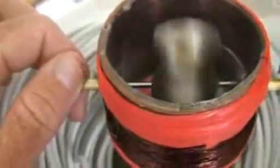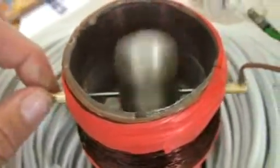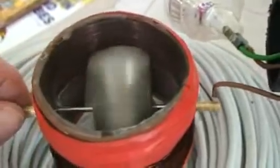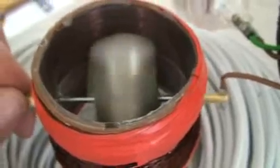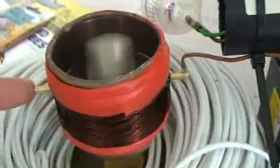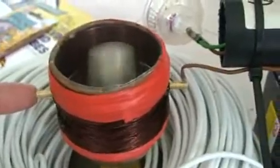And that's essentially very economical — it's spinning without any problem. I can put a reasonable amount of pressure on here in terms of work that the motor is doing, but it's not massive. There's good pressure on here and you're getting a few more sparks. In terms of getting back the back EMF into the battery, I'm not noticing anything specific. If I put a wet finger on there contacting one side of the coil, and a wet finger on the positive terminal of the battery, I get a nice little shock — which is the collapsing of the magnetic field. The back EMF gives me a nice shock, but I don't notice it charging the battery. The battery seems to be draining very slowly.